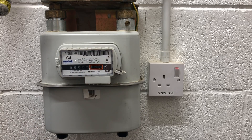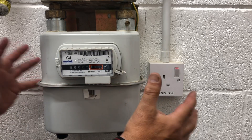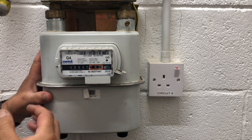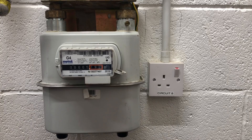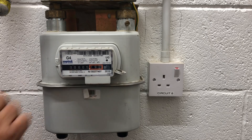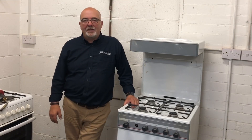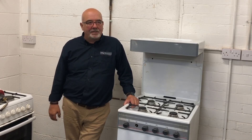That's the volume we're looking to pass. On a small system like this, if it lights before that, that's fine — the idea is that you're not releasing more gas into the atmosphere than you need to. As I mentioned, on a larger meter it's very important that you do the full purge, to make the meter safe. Initially, we're going to go to the appliance, turn it on, try to light it, and watch that 195 reading — then in about 20 to 30 seconds come back and check what it's reading.